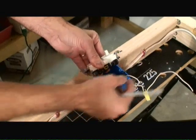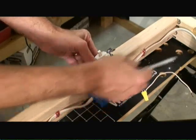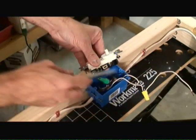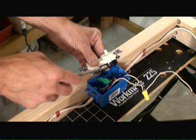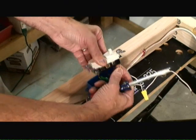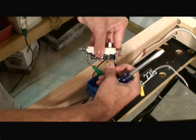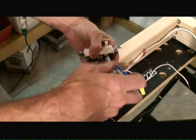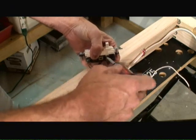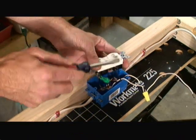On the other side of the switch outlet circuit, we're going to attach the black wire that feeds the light itself, and connect it to the other side of the switch outlet circuit. There's a tab that connects either terminal screw — it doesn't matter which one; we're going to pick the upper one. Notice I put the wire on such that it goes in a clockwise direction so that when I tighten up the screw, the wire wraps around it. When you turn on the switch, power will flow from one side of the switch to the other and then feed power to the light.